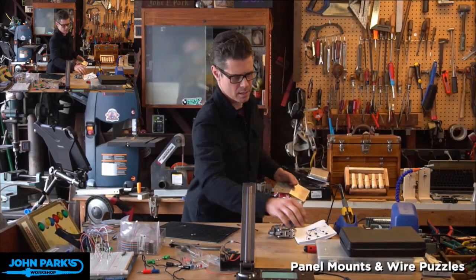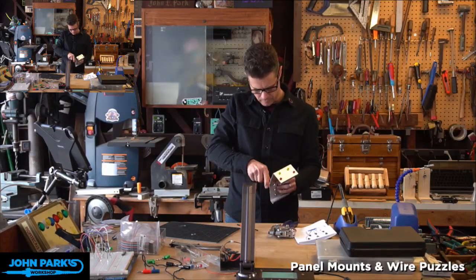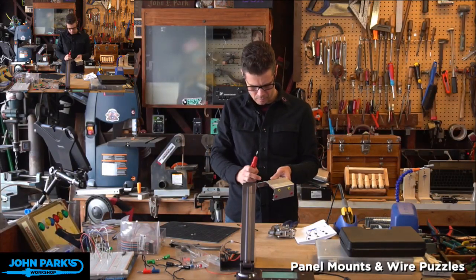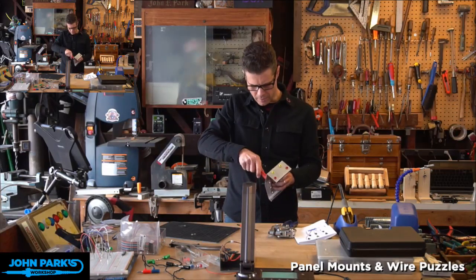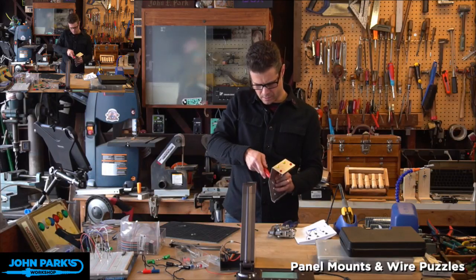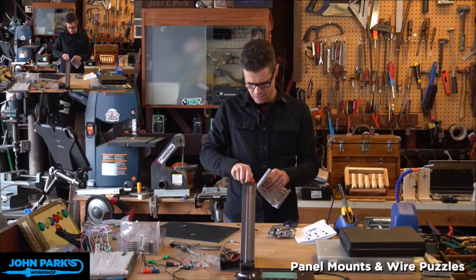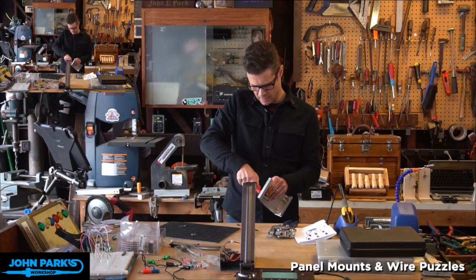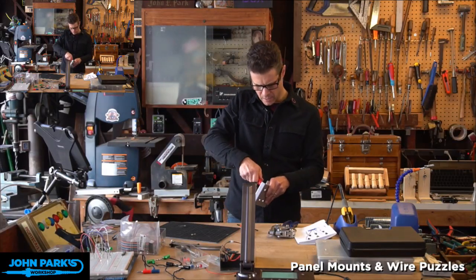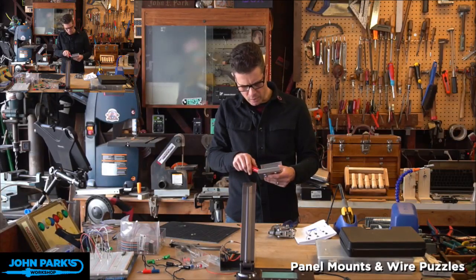So let's go ahead and deburr all of those. A little deburrer. If you don't have a deburrer, you could go through with a file or a knife that you don't care much about, and just get rid of that little lip of stuff there. It's not going to hurt much of anything, but you kind of want to neaten it up, and you don't want those getting jammed in the threads of something or worse. Also, you might not be working with aluminum.